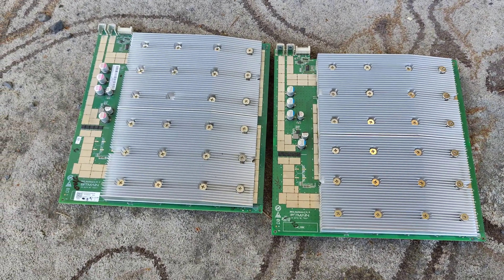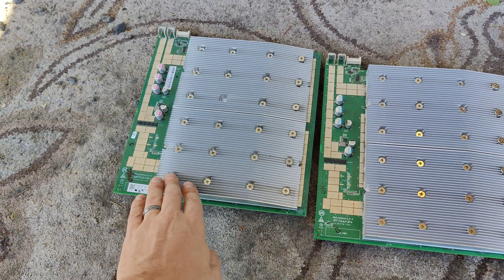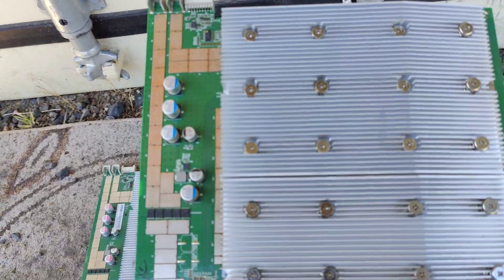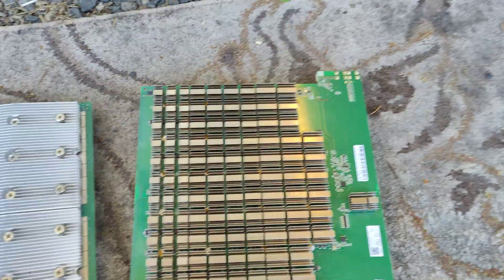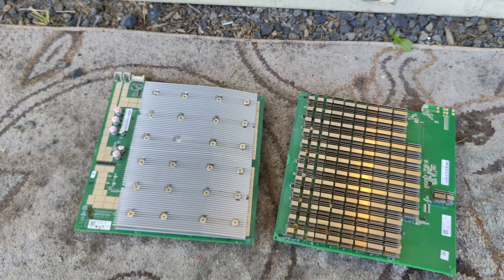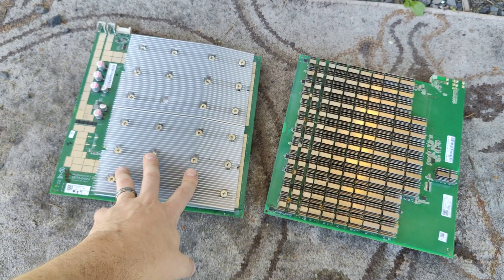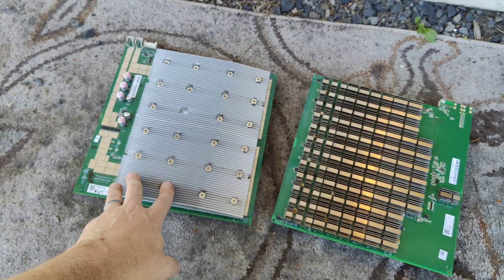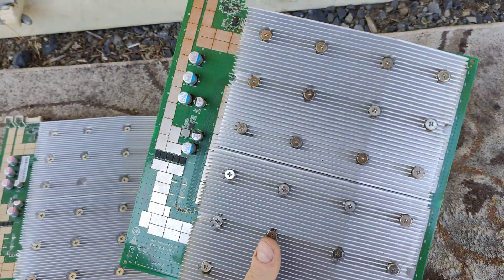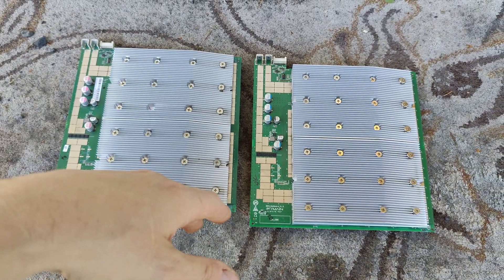Even after restarting, power cycling, and updating the firmware, they just wouldn't find anything. They have 114 chips, so somewhere along the lane the connection was lost and they were showing zero ASIC. If you look at the board, there was no physical damage. Flip it over — basically in perfect condition, nothing wrong with them. It's very rare for these S19 series boards to have problems, especially the way we take care of them. We have nice dust filters, we don't allow humidity to get into the miner, and we don't allow it to overheat. So the fact they showed zero ASIC is probably a manufacturing defect, because that shouldn't be happening.